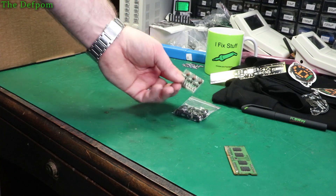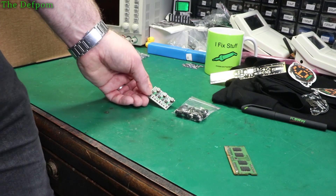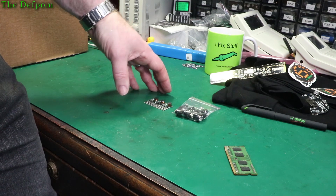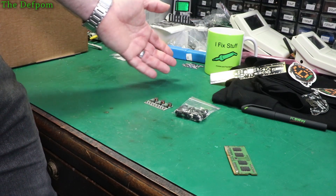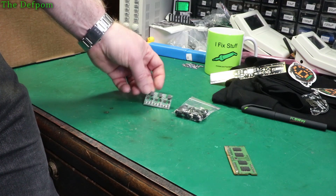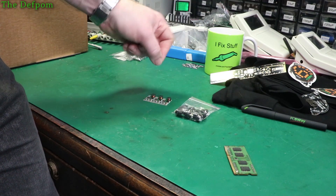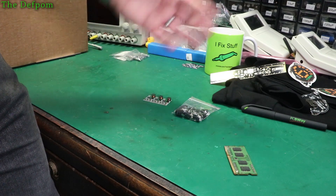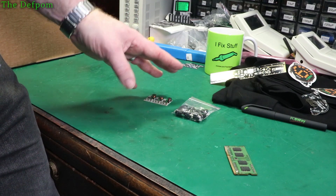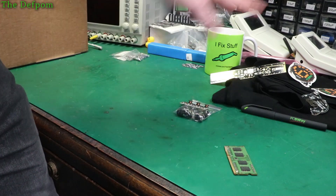I'll bet I use those 9 volt ones actually. I think I've got these as potential ones to use in there because it only actually needs 9 volts. The batteries it's running on use two 18650s in series, and it's obviously got a BMS in there as well. So that actually floats up the negative side of the batteries to make sure they set the correct voltage. Fully charged, you want about 8.7 volts or so. So this can do 9 volts - I think I actually did intend to get these to put in here instead of having variable ones like the other ones I've built. They have variable adjustments so I can tune the voltage inside, which is supplying the BMS so it's only doing minimal work and not overloading the voltage too much. I've been setting those around 9 volts, which is why I think I got these ones - I might just use these, so I've probably got the stuff I need to finish doing those.